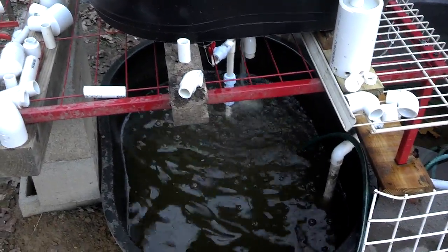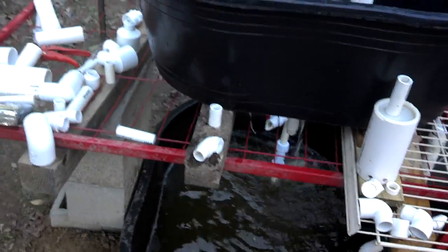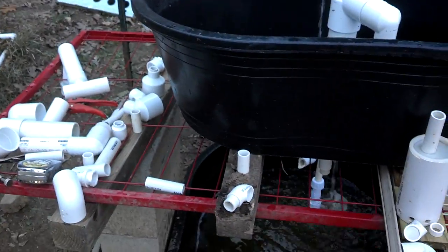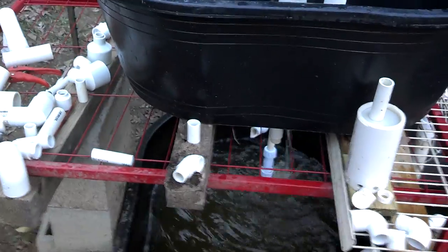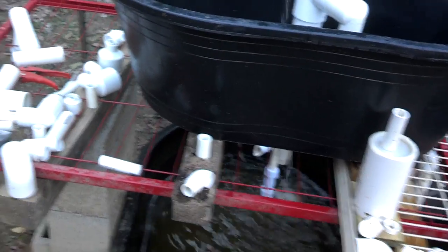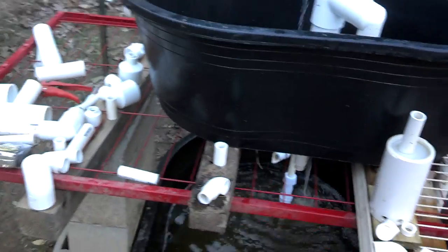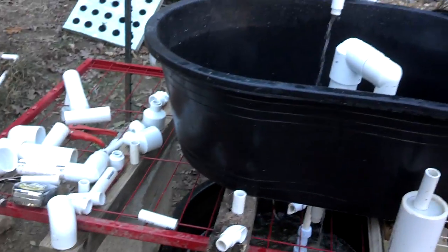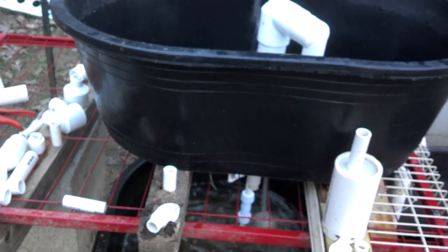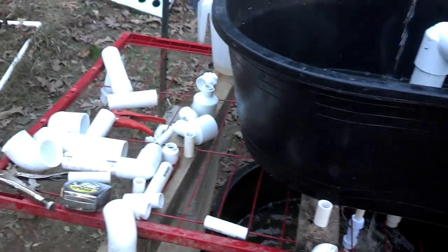As I stated earlier, remember — and that's the whole point of the above-bed siphon — keep your siphon and your drain as two separate things. I learned this when I made my fish tank overflow from the bottom: you don't have enough room for both air and water in your overflow pipe, and it was siphoning my fish tank down. By using a larger pipe, I had room for both air and water, so it just overflowed instead of siphoning.